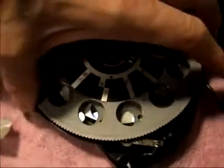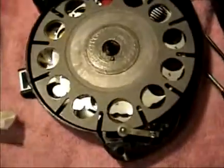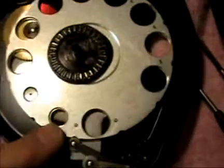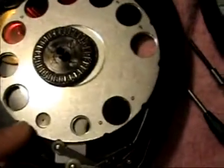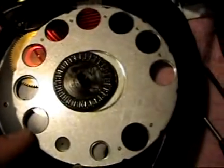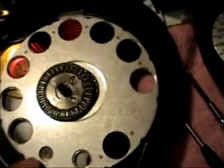With the Phoropter further disassembled, the quarter diopter wheel consists of one opening and eleven lenses. Next is the three-diopter wheel, which again is eleven lenses and one opening. Then next is the auxiliary wheel. Usually it's not necessary to disassemble deeper than this, although there have been times when something gets jammed in the gear mechanism underneath and further disassembly is required to get it back into operation.